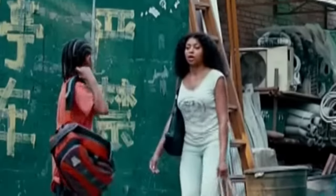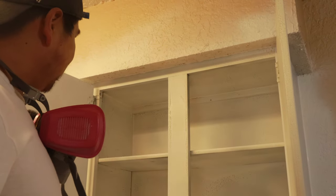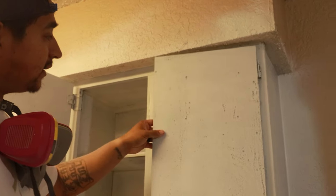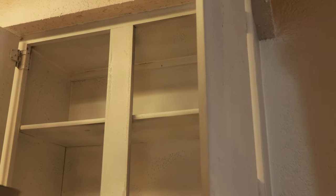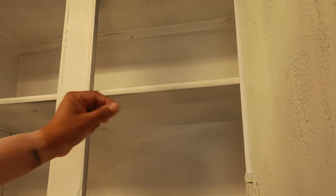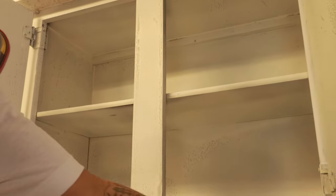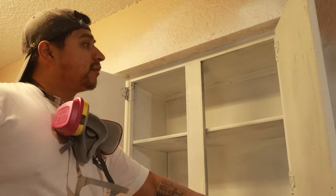This place is disgusting. We cleaned, we sanded, and it still looked like it wanted to drip — still greasy. But the primer grabbed and it's on there. Now we're caulking the lines that we can see, because it was black before and we couldn't really see the little cracks or gaps. We'll let this cure a bit more and then do probably another coat of primer before we do a coat of paint.